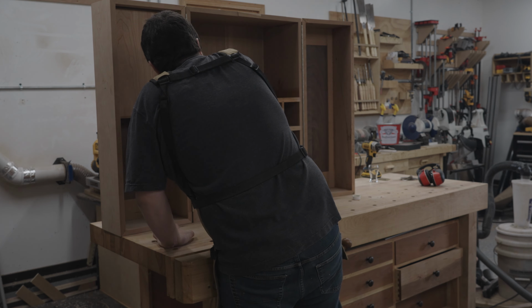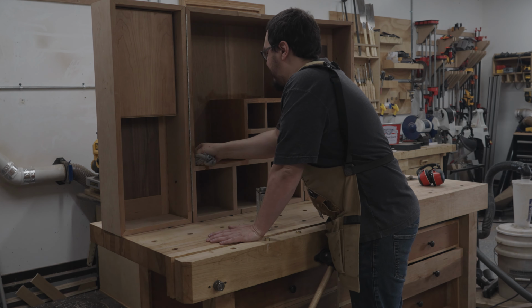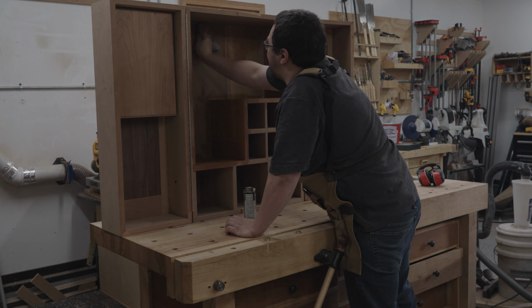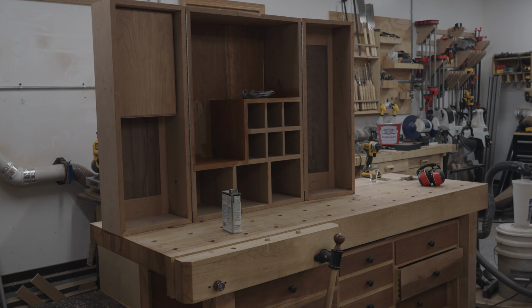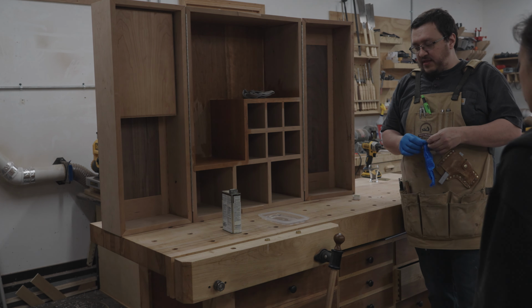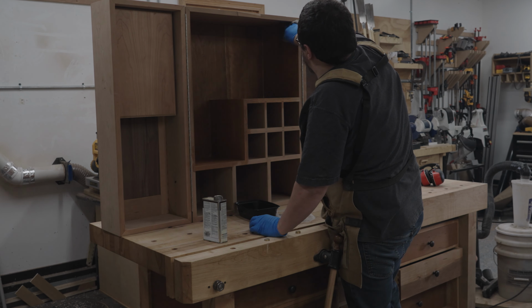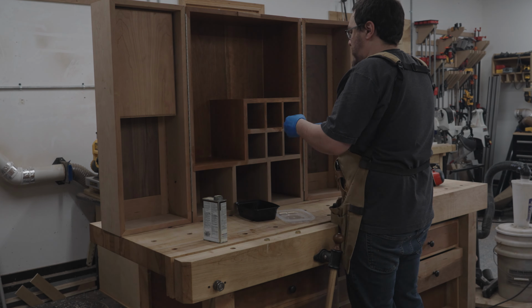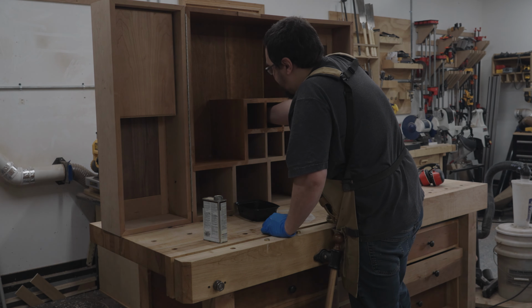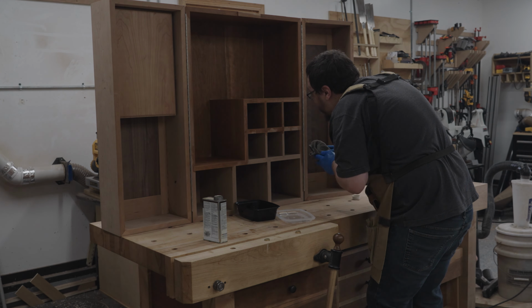For this project, I decided to go with an oil-based finish. Now, normally, I would have gone with a film-based finish like lacquer, because it is that much more resilient and can take a lot of damage. However, this project is going to hold very sharp tools, and metal tools at that, so the likelihood that the lacquer is going to end up getting chipped is pretty high. Oil base doesn't take quite as much damage, but it is way easier to fix, so if anything does happen, I can just lightly sand it and apply a little more Danish oil.